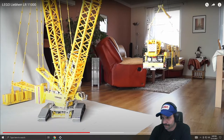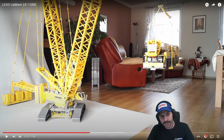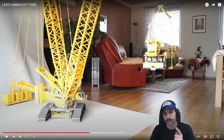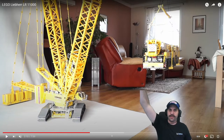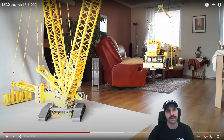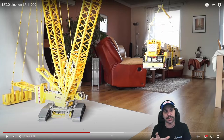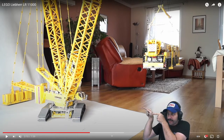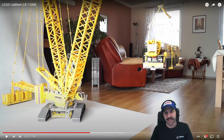Yep. So, okay, how does it lift it, Crasher? Counterweight. Now, because the crane is so far away from the initial lift point, that crane over there is called a telescoping crane. This is a telescopic crane, because the boom is telescopic. It just extends. The lattice cranes need to be assembled. Usually telescoping cranes, because they're more mobile, are more of a one-piece package. You assemble lattice crawler cranes on site. You need a smaller crane to make your bigger crane. Yes, cranes. They multiply.